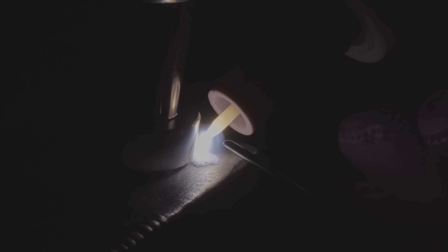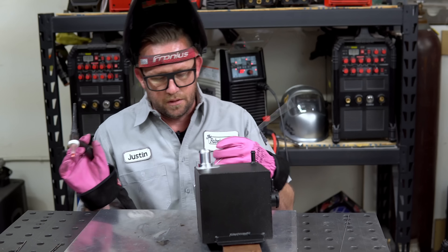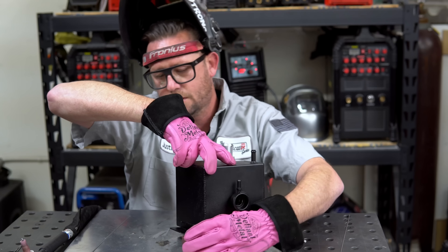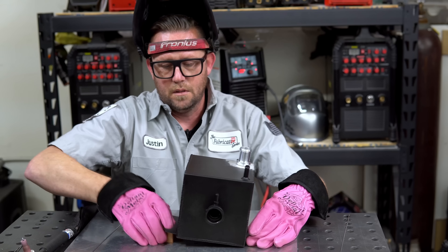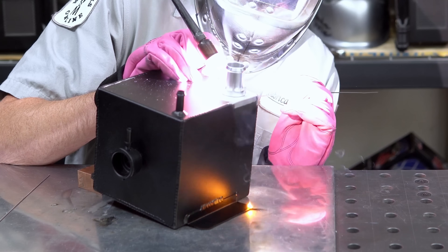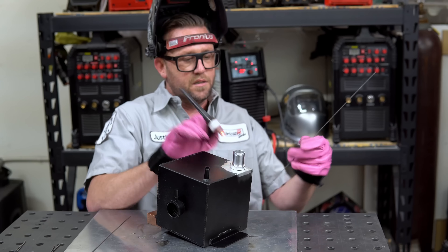Okay, we're on the port. See how it's bleeding over just a little bit? Let's drop some filler in there. Now they're combined. Let's get out of it. We're just going to the opposite side here. We've got a good build up on the base of the barb — see how the heat is just overflowing to the tank. Add our drop of filler. And a drop of tungsten, because we all know that adding tungsten to the pool makes it so much stronger.